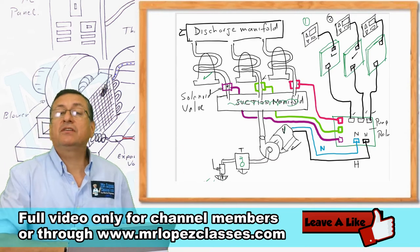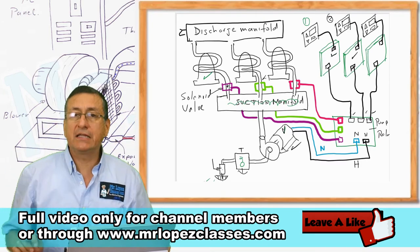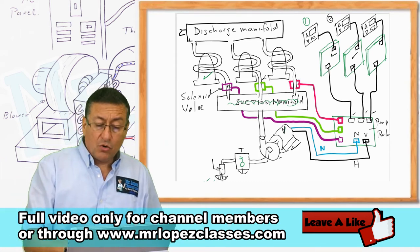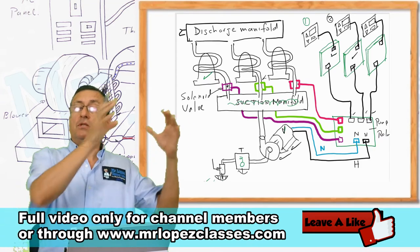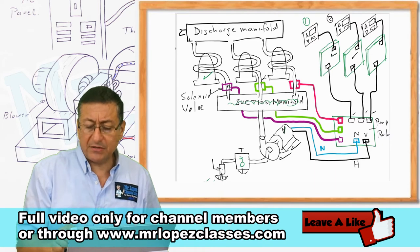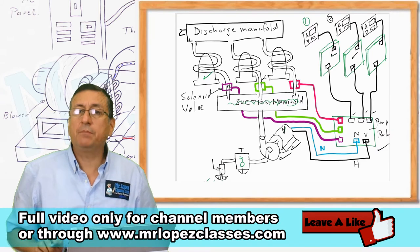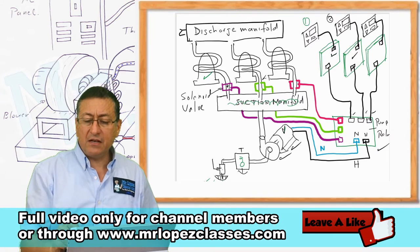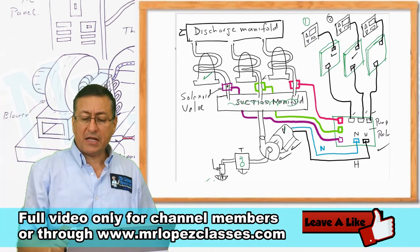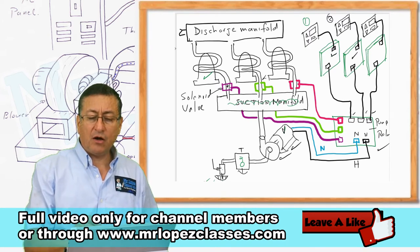This is a wonderful system. The only new component I need to introduce is a large raw water pump with the capacity for all three units simultaneously. That raw water pump comes with a central box. The central box has a PC board that receives signals from the thermostat and the computer of each evaporator, and sends signals to activate the pump and to open the solenoid valves per each compressor.